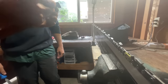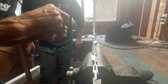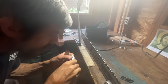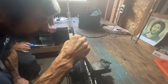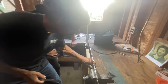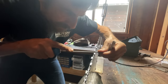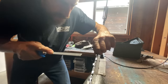Measuring the depth gauge, this chain comes in at about 35 thousandths instead of the target 30 thousandths, so it'll be cutting a slightly larger chip. It's close but not exact — I realize this chain isn't just the same chain with a different edge, it has genuinely different geometry.